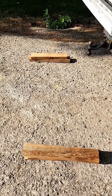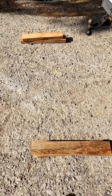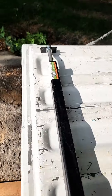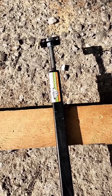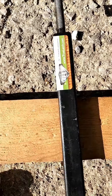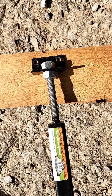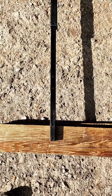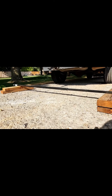Got two blocks here on the ground, basically two sets of 2x4s. You can use one set of 2x4s or two sets, whichever one works, in order not to scratch the paint on the brace. When you set it on the ground, set your brace on the blocks. Don't set the threads on the brace like this — you're going to warp and bend your threads. Put it on the body of the brace right there, with this end down at the end of the blocks, so it'll be off the ground a little bit like that.